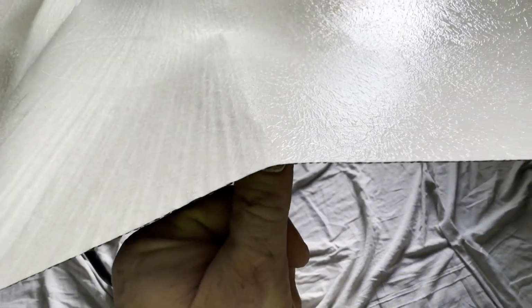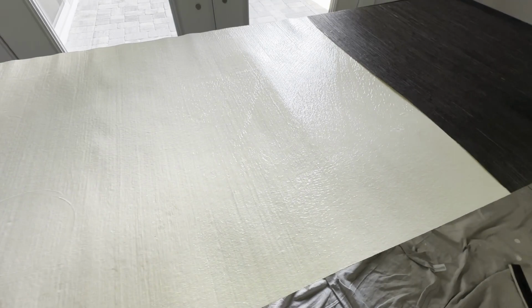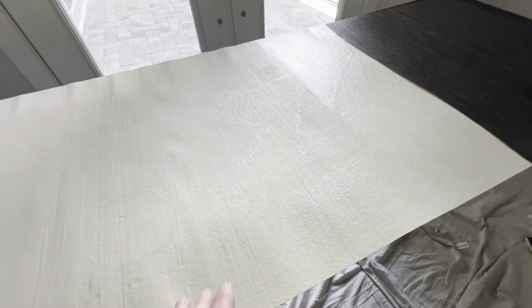Take a look at the backing. It's just paper. If we don't let this book sufficiently, this material will not get sufficiently wet, saturated actually, and it won't expand properly. But it will do that. See that? It's expansion. It'll do that on your wall, and you'll have buckles.